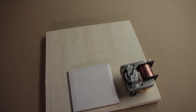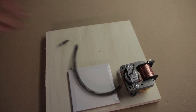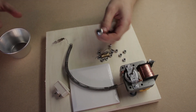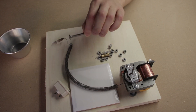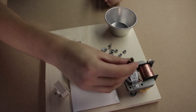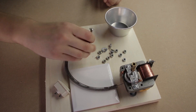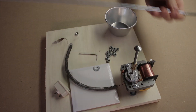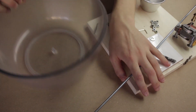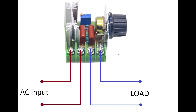The main components for this project are a wood platform, a motor — in this case a shaded pole motor — a ceramic tile, a heating element, a switch, an aluminium cupcake cap and some steel nuts, a stainless steel bolt that is around 5 mm in diameter, and a motor coupler to connect the bolt and the motor shaft. We also need a threaded rod that we are going to cut and a large bowl to hold back the sugar drops. To control the heating and the speed of the motor we will need two dimmers like this.